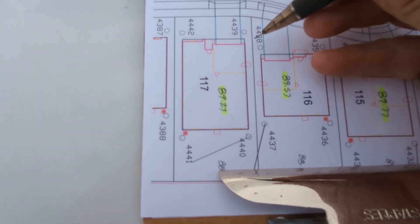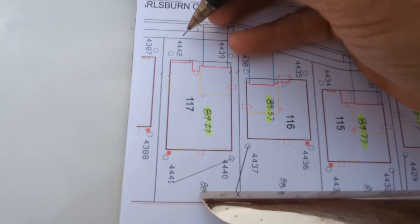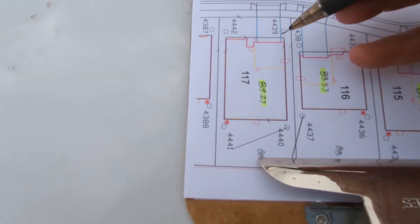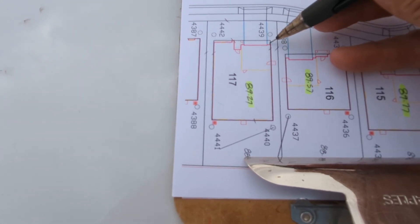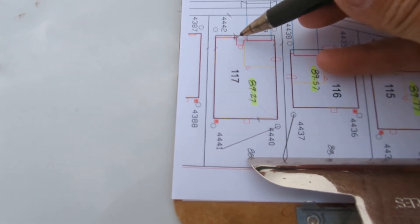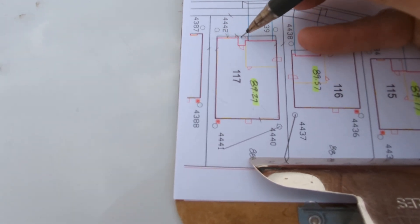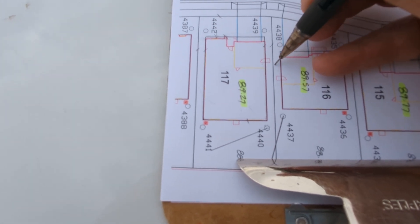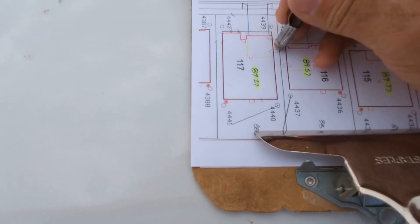What I did today on these forms is form certifications. Out here in California, since lots are so small, you may have a five foot side yard here, a ten foot side yard there, a 20 foot setback, and whatever the backyard is. We shoot the outermost building line as our form certs — we check them vertically and horizontally. We'd get a shot here, here, here, and here. This column isn't part of the building line, so we're shooting the furthest outermost lines each direction to verify the five or ten foot side yard and confirm there's no encroachment. As long as our calcs are good and they go off our nails, everything's normally pretty darn good.